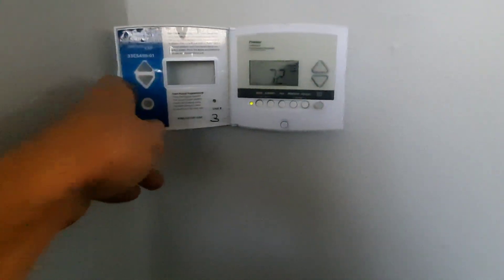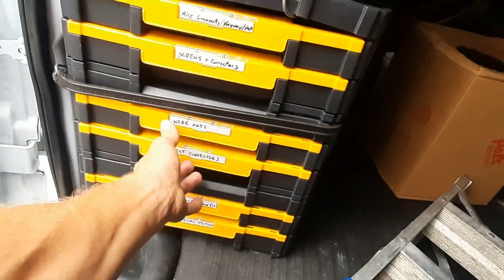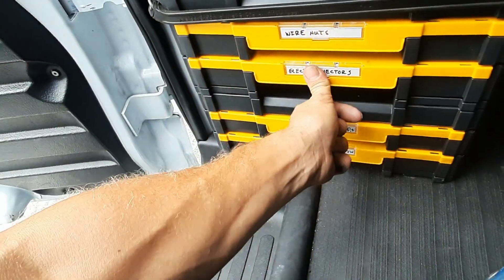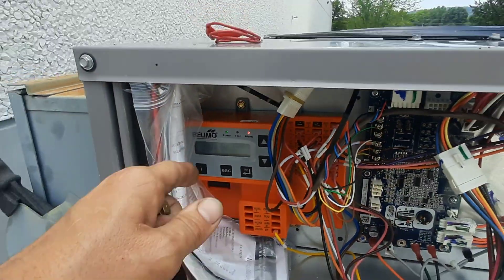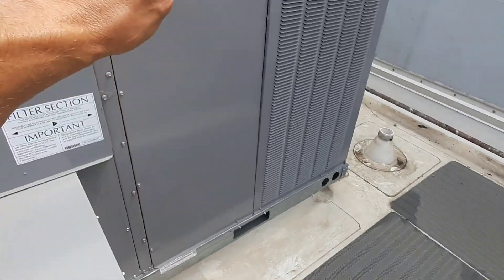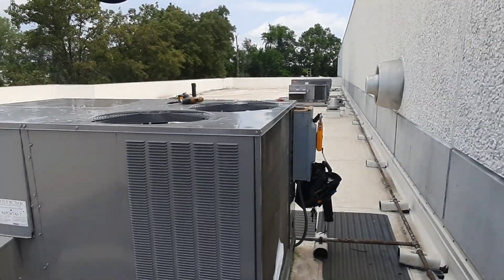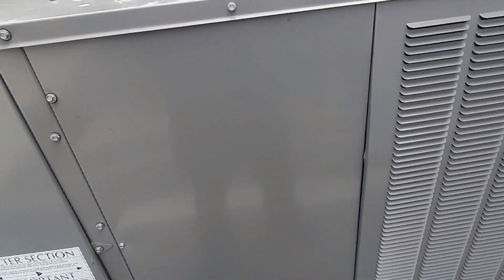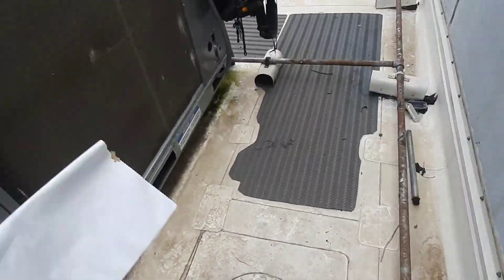This should be capable of two stages, so we're just writing everything up at this point. I'll use a little electrical tape on that as a jumper rather than my alligator clips because they might fall off - we don't want that happening. The system's been running for a little while, we have a 55°F supply temp. I'm not making any adjustments on this - we're going to let them decide what they want to do. They called for a service call, I fixed it - found the freeze protection bad, everything's operational.